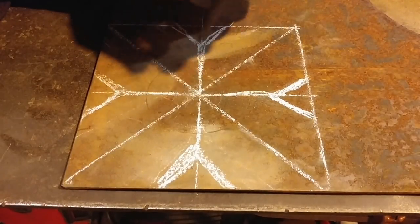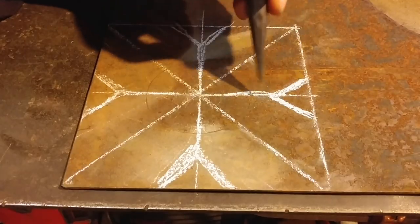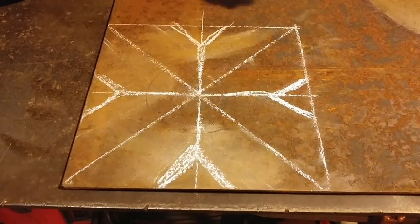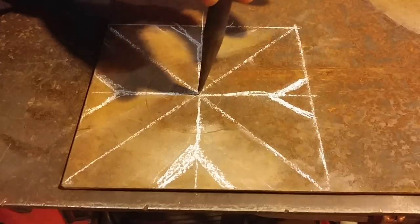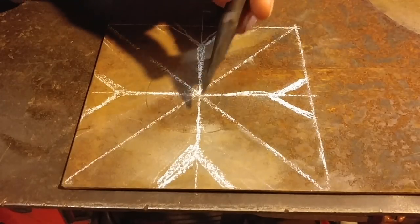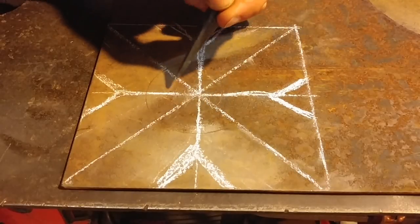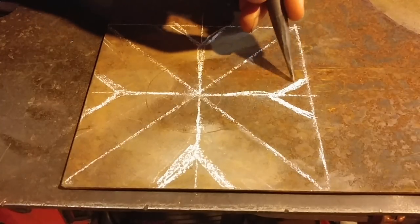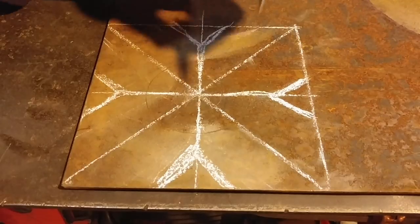I need a recess where the bulb is going to be. Once I figured out the general dimension I drew in some 45-degree cuts to give me some space for my leaves. Then I took a pair of dividers, found the center of this point, and scribed out two circles. The inner circle is where I'm aiming to drive back, and the outer circle is where I'm wanting to cut my lines back to. I want them to come back a little further to give the leaves more gap in between them.